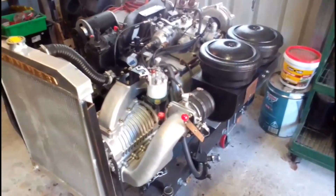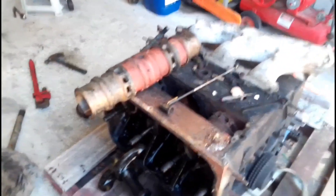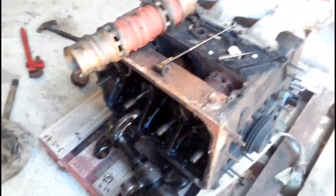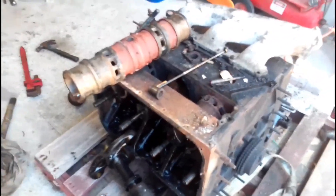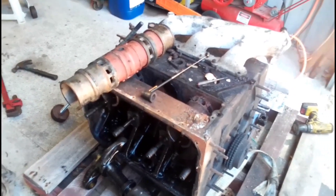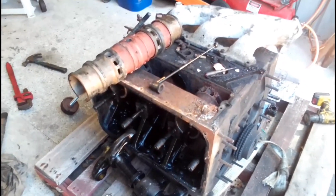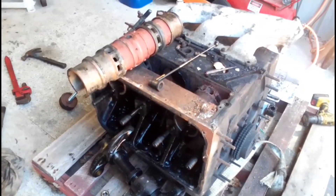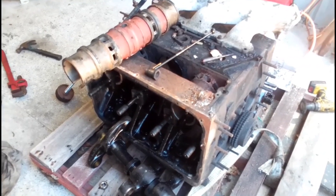If you want to see that, be subscribed — finding pistons and rings is really hard. So that's my puller for pulling out liners and how I do it. I think it's one of the hardest jobs when you're working on a TS3 or any horizontally opposed diesel engine. But if you can make pullers and things like that yourself, you save yourself a lot of money. There are probably pullers available to buy on the market, but they're very expensive and you may break them as they're not intended for this. If I break a threaded rod it's no big deal — it's $5 or $7 from the hardware store. I could make it a lot stronger by welding in triangle corner pieces into the I-frame. You will need it as strong as you can make it — it takes a hell of a lot of force to pull these liners out.